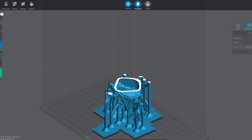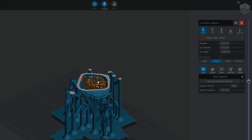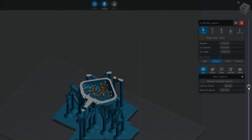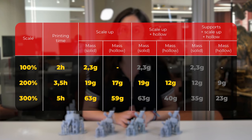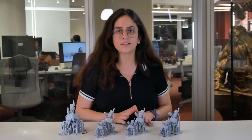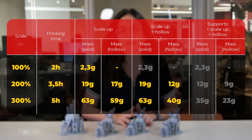In the second scaling technique, we increased the helper by 200%. As we left it hollow after increasing the scale, we needed to add internal support to the part, which can be done automatically in the Lychee program. It works very well most of the time for internal areas with normal or high density. In the 200% enlarged file, the 17 grams of resin from the first method now consumes almost 12 grams — saving approximately 30%. Increasing to 300%, which consumed 59 grams with the original hollow file, it dropped to almost 40 grams — a considerable saving in material.